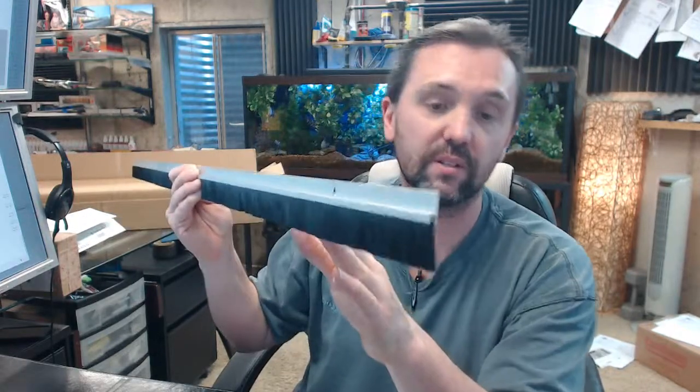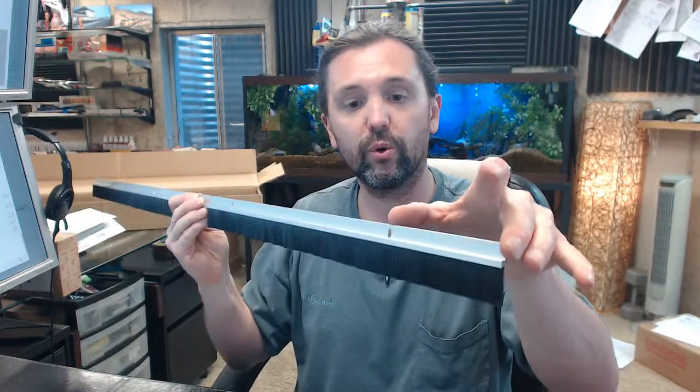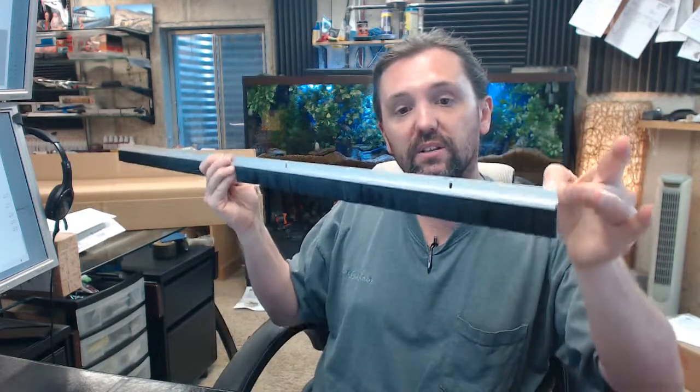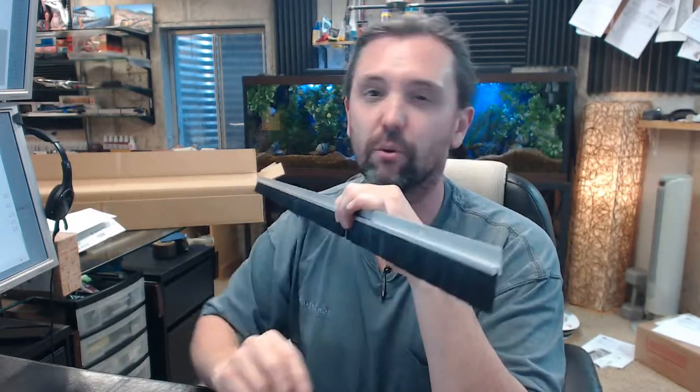Now, available in several different lengths. This happens to be a 42-inch piece. If you happen to need to cut this down to something smaller to the point where you eliminated that slotted hole, you'd be stuck drilling another slotted hole, and drilling a slotted hole is naturally difficult. It's nice to have that slotted hole there because it will give you the ability to tailor this to the bottom of the door to account for a door that may not be plumb or a sill that's not level. And it will help compensate for a misdrilled hole. When you're pre-drilling the holes for the screws, the drill bit has a tendency to walk a little bit if you've not used a center punch before it pierces through, whether it's aluminum, steel, wood, or fiberglass. And that slotted hole will help compensate for a misdrilled hole as well.